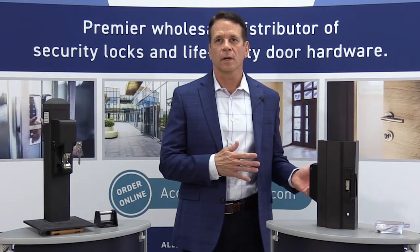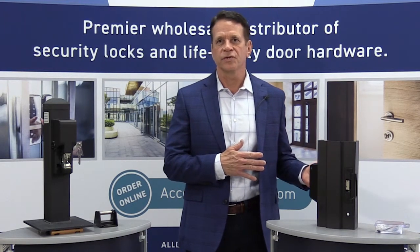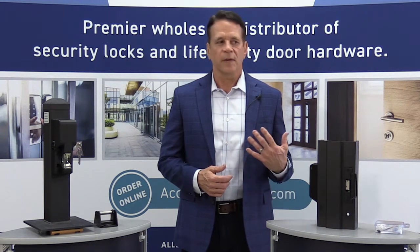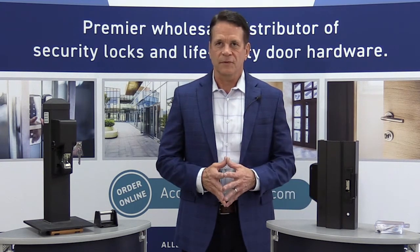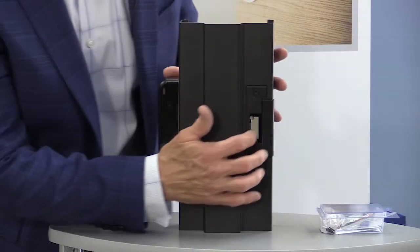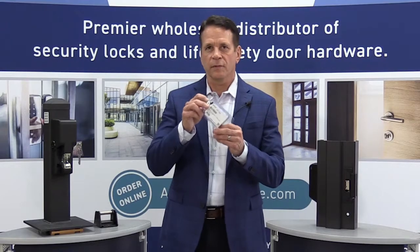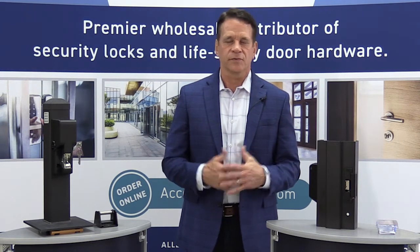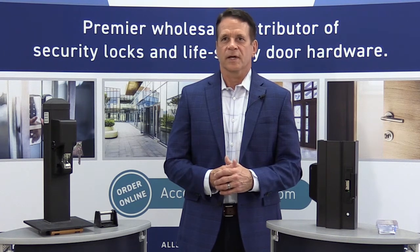Bill: How is this product available? Mike: It's available in either a 1500 series or a 1600 series strike, meaning it'll work with a latch lock or a mortise lock with a one-inch deadbolt. We're offering it in three different variants: the convenience package, which is a non-monitored version; the security version, which is monitored with latch bolt monitoring and door position switches; and a pre-paired kit that comes with a hub from the factory for a one-door application. It puts out a Wiegand output, so it'll work with any access control system — it's just like hooking up a Wiegand reader.